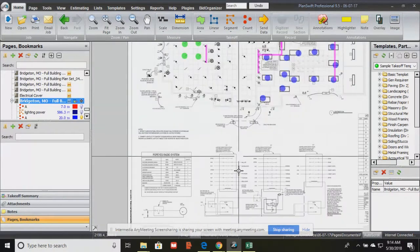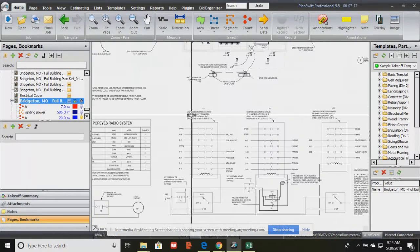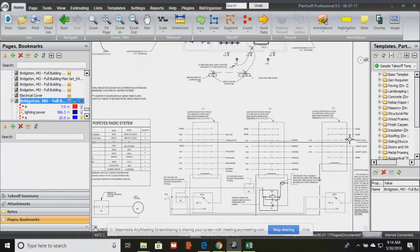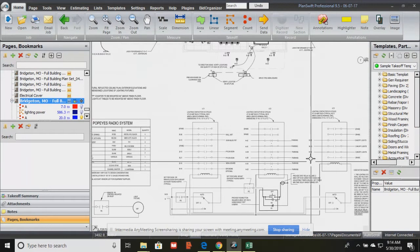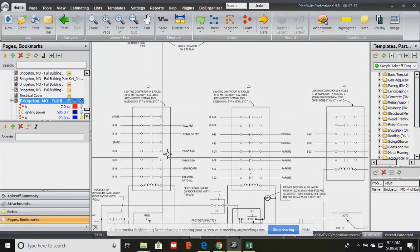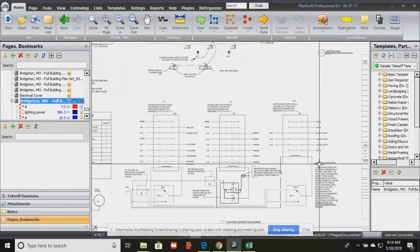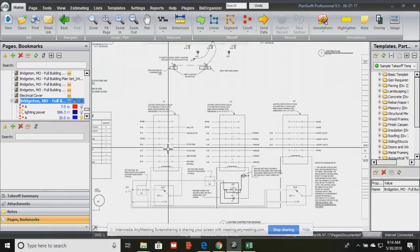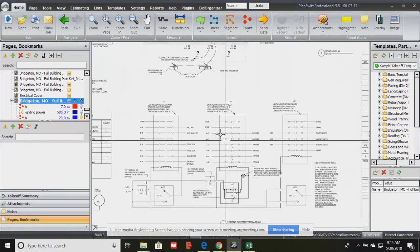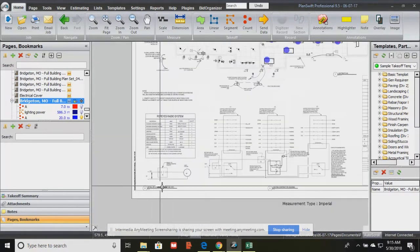All right, so this is representative of LC1, lighting control 1, and these are called lighting contactors, and so the electrician knows how to connect each of these. These are basically just switches contained within their own little mechanism. One end of the switch is the light. The other end of the switch is the panel, the B panel. The other switches are the lights, and then the other portion is where this is powered up. Okay, so this represents LC1, LC2, LC3, and that's no typo. So this tells the electrician how to physically connect the little devices, contained within metal panels, and they physically connect the wire from the lights and then back to whatever panel the lighting control circuitry itself needs to be connected to. So it's showing you all of that stuff.